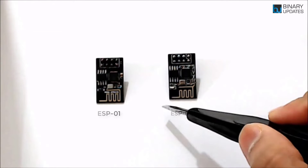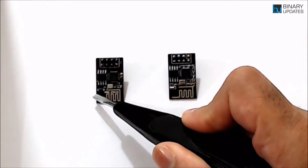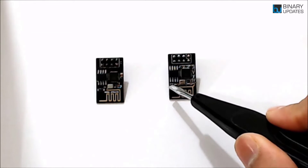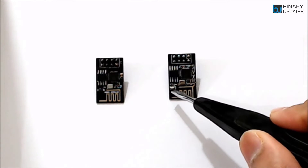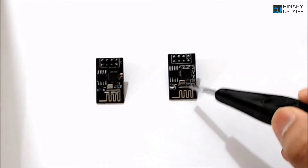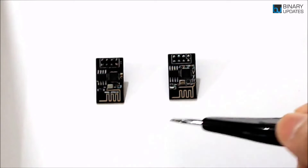There's a major difference between both ESP01 modules. On the ESP01 generic module we have two LEDs, while the ESP01S has only a single LED. The ESP01S also has a built-in resistor for the reset and enable pin, which is why I feel the ESP01S is more stable than the ESP01, but both work absolutely fine.